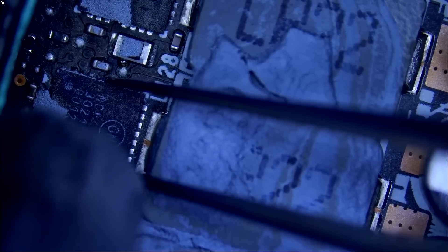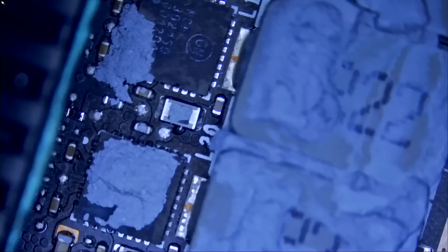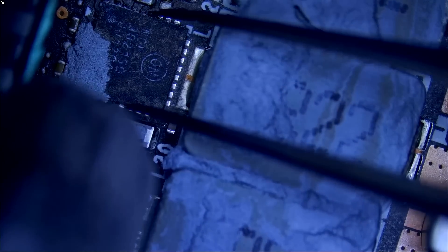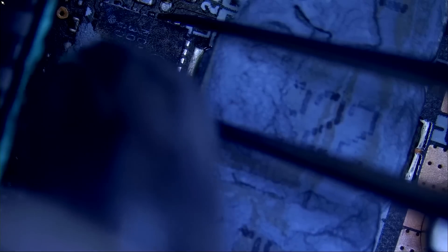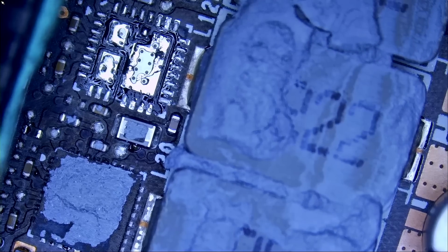What matters right now is this component is bad. I don't want to burn my mat, so I placed the Northridge Fix board holder metal between the card and the mat. The board is going to take a lot of heat before we can desolder the chip — it's a thick board with a lot of thermal mass. Solder only melts when the board itself reaches the melting temperature of unleaded solder. The board keeps absorbing heat until it reaches that temperature, and then we can remove the chip.